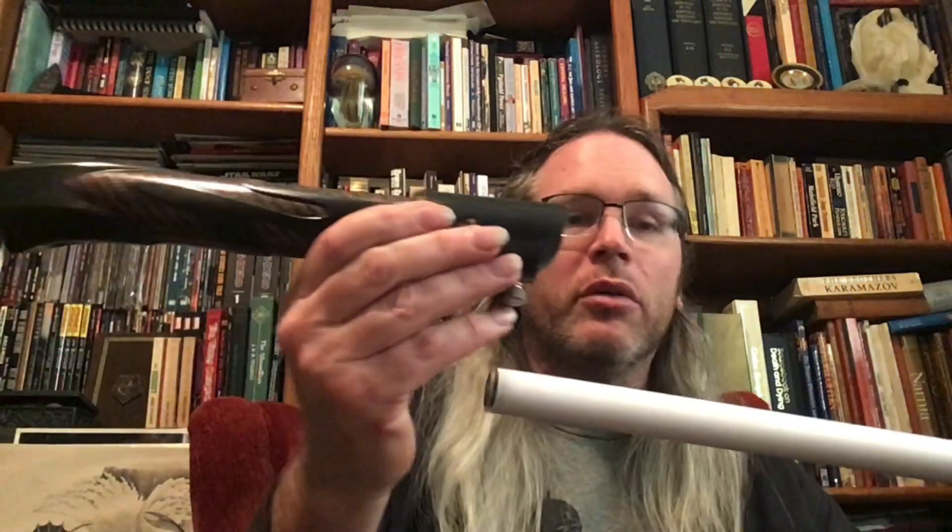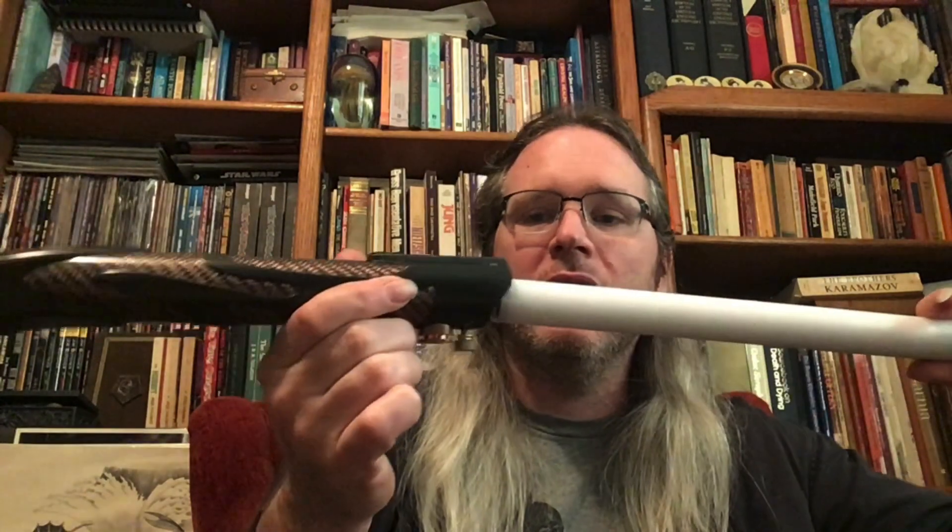Now I'm demoing this at the beginning of the video — you noticed I had a saber up. This is not a Bendu Armory saber; this is an Electrum Sabercraft saber. The reason I'm using this is that under most circumstances, soldering the LED strip directly to the PCB is not anything you're going to notice a difference in. It is a little bit more secure. One of the weakest spots in a saber is always going to be the wire connectors, because they wiggle around, the solder breaks and they come undone. Having a wire to an LED come loose was how a lot of my sabers eventually went down and had to be repaired. So the less you can depend on wires, the better. That's one advantage. But the light advantage is nothing you're going to see in, for instance, a Bendu Armory saber — the light coming from down here versus up here. You put this thing in the saber and that much of the blade goes in.